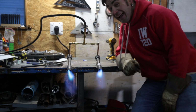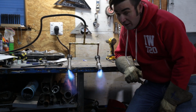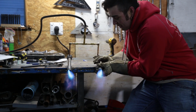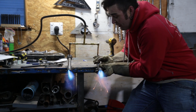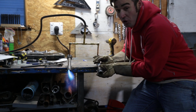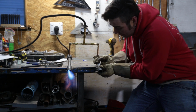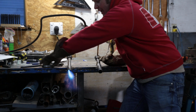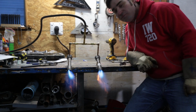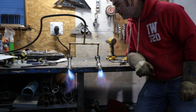Now, a little bit of behind the scenes. I tricked you. I did test it once. You will find when you're setting up, if this pipe is too far down, it'll choke itself out. So you might have to play with the length of the bottom of your hourglass. But when you find that sweet spot, she'll work.